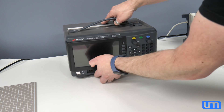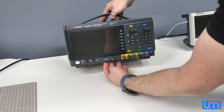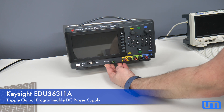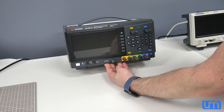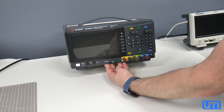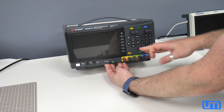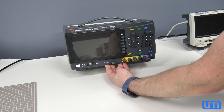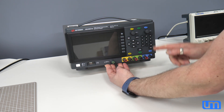So here it is. Please tell me there's a fold-out. No fold-out feet. I hate that. Anyway, this is my new Keysight EDU36311A. It's a triple output programmable DC power supply. I've got three different channels. I believe one of them is voltage limited and two of them can be linked. So you don't get true full three independent channels up to 30 volt, 1 amp. The 6 volt, 5 amp limit on one of them is perfectly fine because most of the stuff I'm doing is 5 volts.